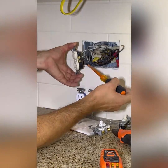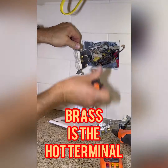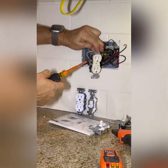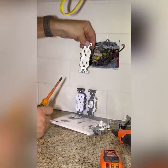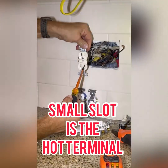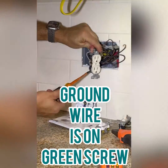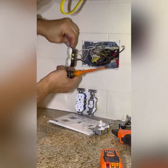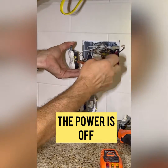You can get a better view of the receptacle here. The right side with the brass screws is the hot side — you can see the black wire there. On the neutral side there are silver screws and white wires. If it's wired any differently, somebody got that wrong. You can also tell the hot side by the small slot and the neutral side by the longer slot. Leave the ground wire connected as long as possible until you've removed the other more dangerous connections.